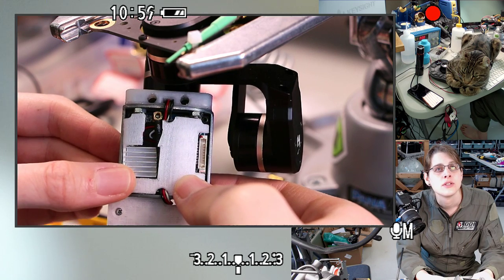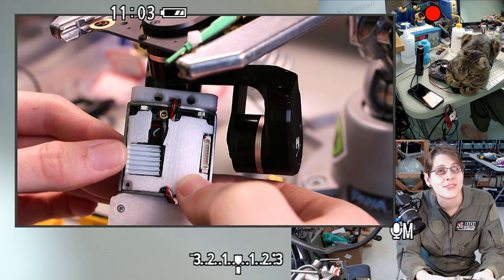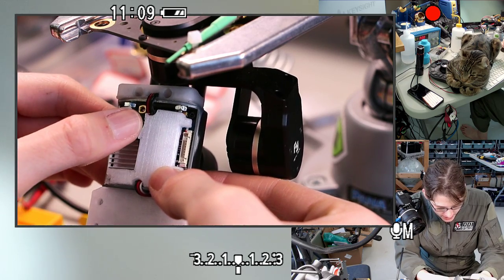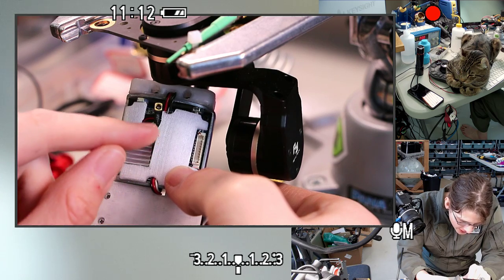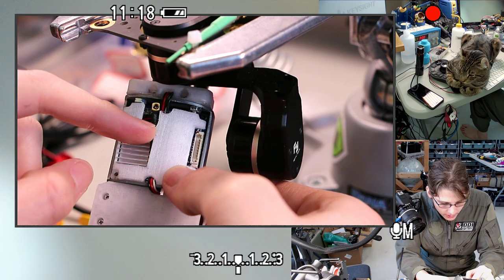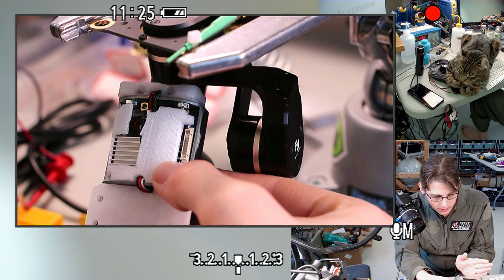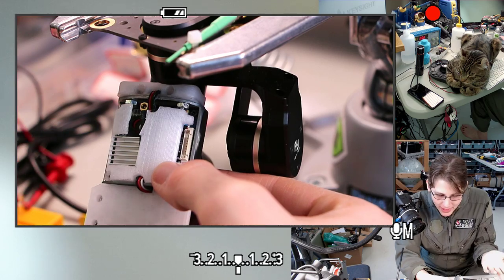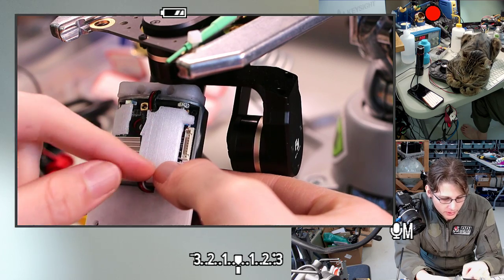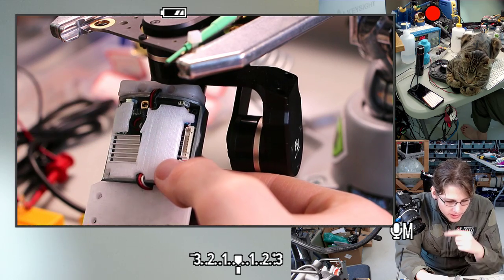Then we've got some problems. So the heatsink, definitely closer to the edge than I thought it was, which would mean that this already thin piece needs to be even thinner, which is not so good. And we needed some kind of cutout for this. It looks like it didn't have to be that far down. It looks like it could have ended right about where my fingernail is, and it would have been fine. And then this whole heatsink thing just needs to be moved about, it looks like a half a millimeter closer to the edge, which might just mean that this piece can't exist anymore. And that then this is then supported mostly through this path, which is a little bad, but I could try to add a support rib right along this edge that might help with that.